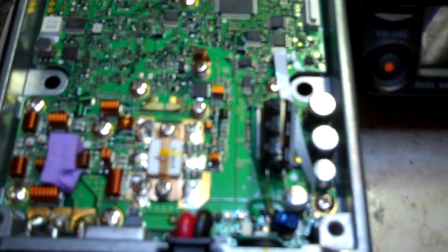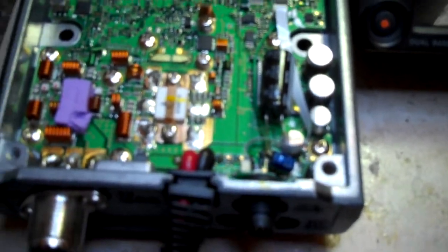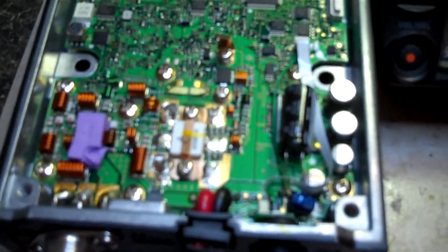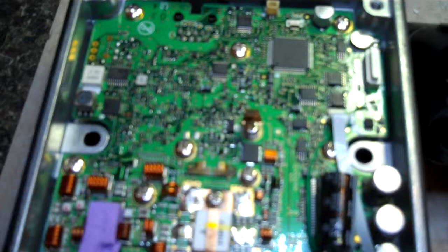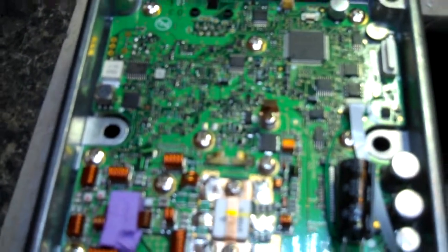Pretty simple fix. Very common problem. This filter is installed typically without DC blocking capacitors, which is called for in the spec sheet. So you get electro-migration inside and the filter will eventually short out. It fails. But before it fails, usually you get some crackling on receive — a very common situation.